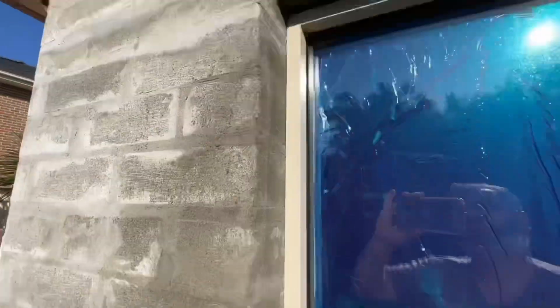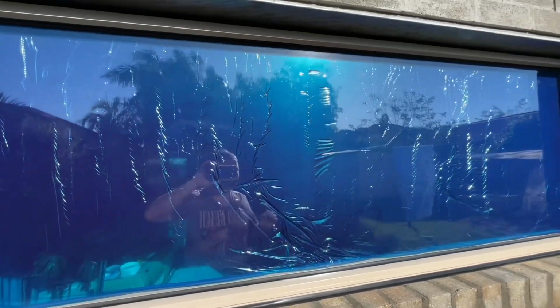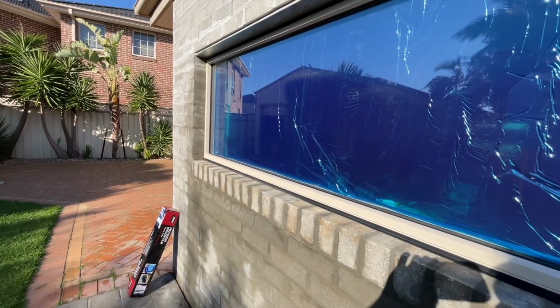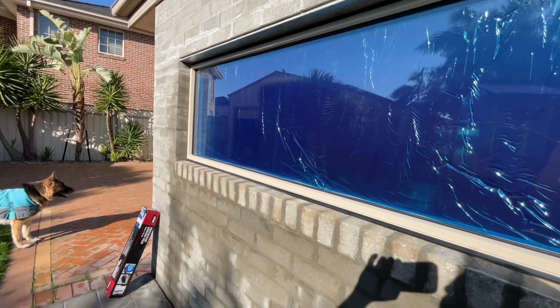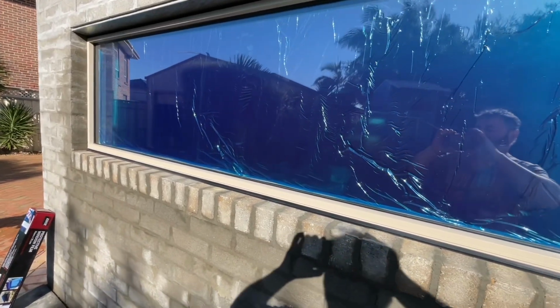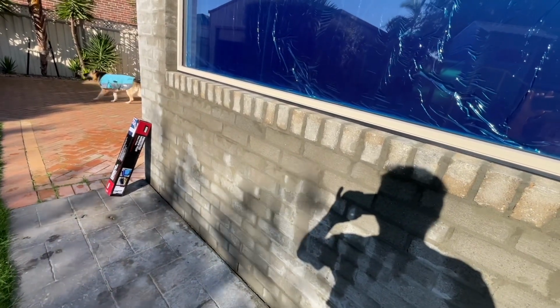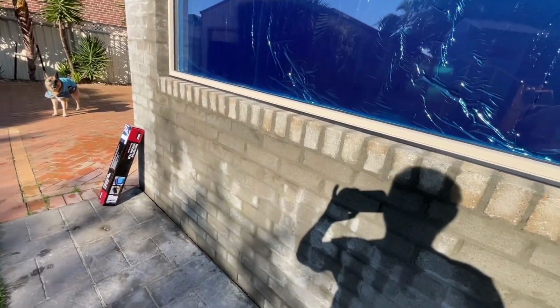on the aluminium. So yeah, our tape should stick, and I use the blue tape, which is a very low adhesive, and you're supposed to be able to leave it on for around 14 days, which is 2 weeks. So hopefully this won't be on that long, but if I get some bad weather tomorrow, it might be on for at least a week, because even if I get to seal it tomorrow, I need 2 dry days after I seal it, but it really needs 3 days before it can be painted over the top of. So I probably won't get to it these days off.